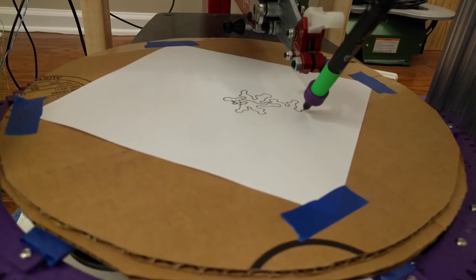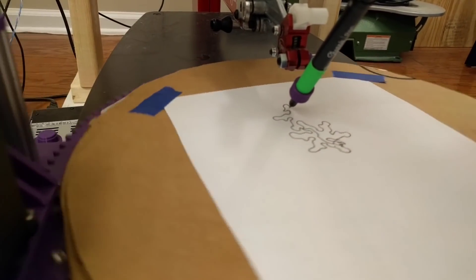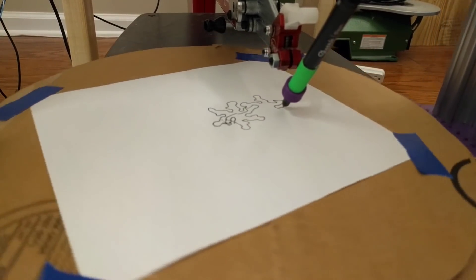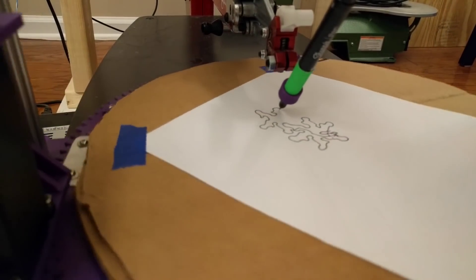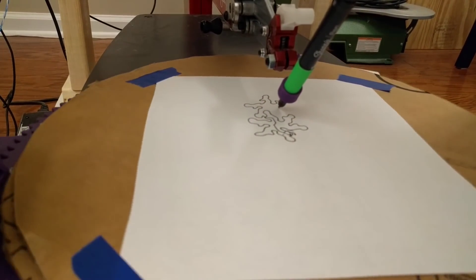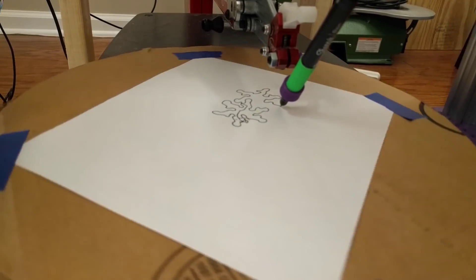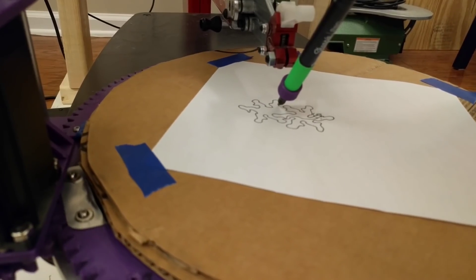You'll notice that this piece seems to cut a lot faster, but the linear speed at the blade is still approximately the same, assuming I didn't make any major errors in the code. Since we're further away from the center, pivoting around our current cut location means a longer arc travel and more Z rotation. This demonstrates why that huge step reduction comes in handy — in order to end up with any kind of reasonable cut time, we really need to be able to rotate this thing pretty quickly.